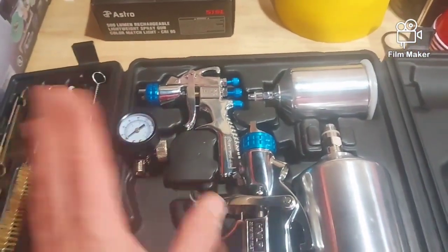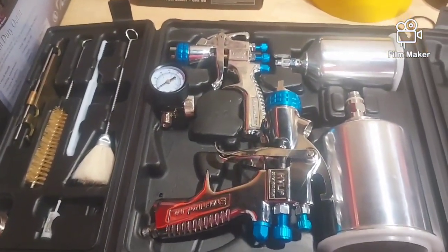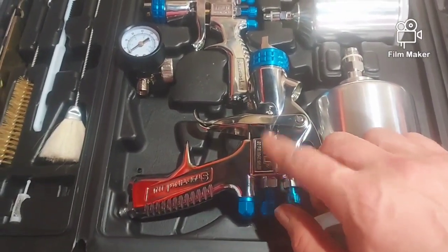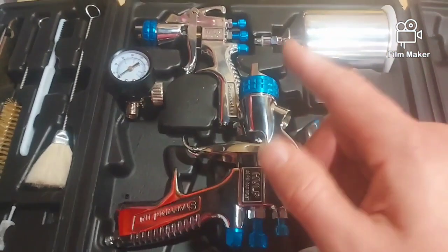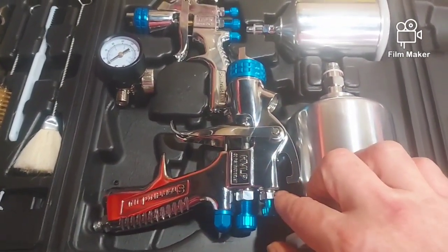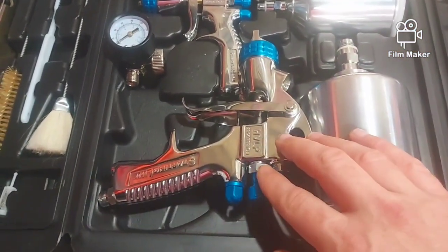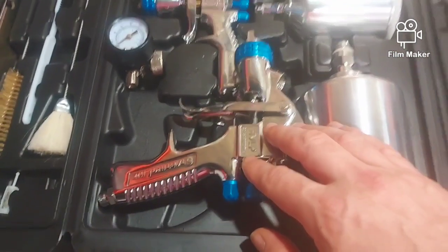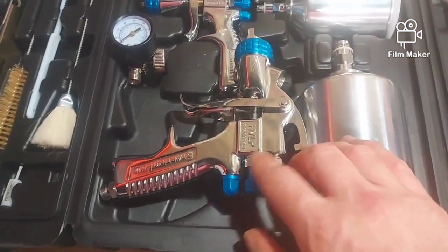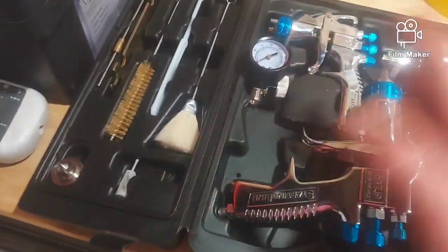Run a little lacquer thinner through it, clean it up, throw it back on the shelf. Some things I'd like to see different: I'd like to see the jesus clips gone — give us a screw. I'll accept the poor quality castings; I'm a little disappointed in that from DeVilbiss, but we'll take it because this is a cheaper build quality and it's meant to be that way. There are no o-rings in this gun — usually on harbor freight guns you get o-rings all over the place, but use it once, clean it up, pull it out four or five months later and all the o-rings blow out. That won't be the case here — these are machined to a better quality, thus you pay the bigger price tag, but you don't have to worry about those o-rings. It's a really cool kit.